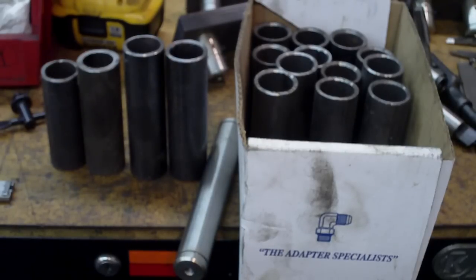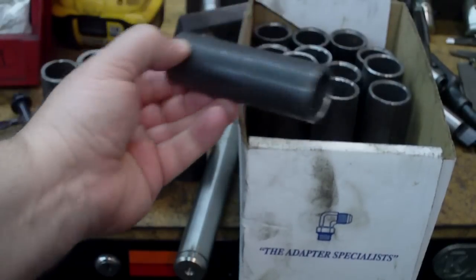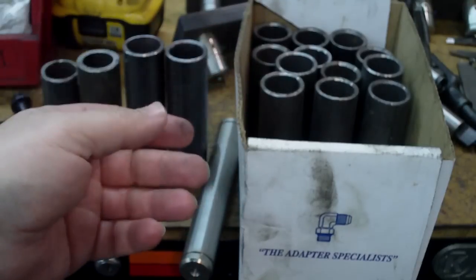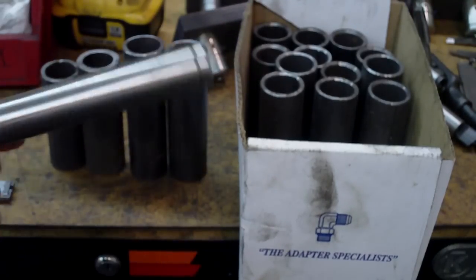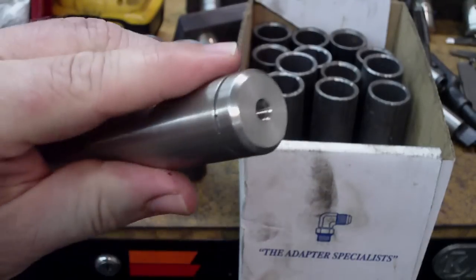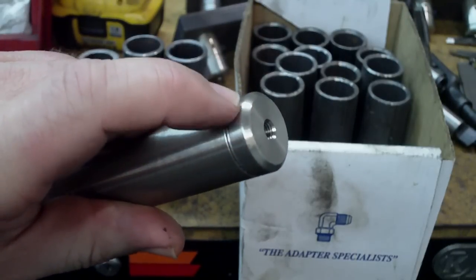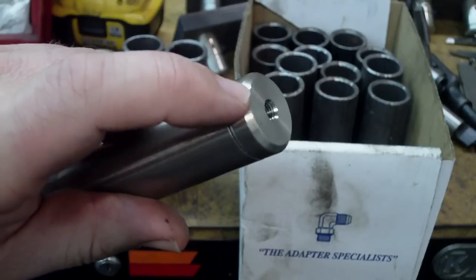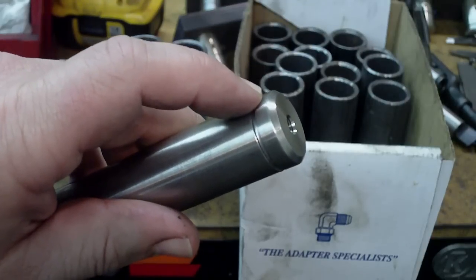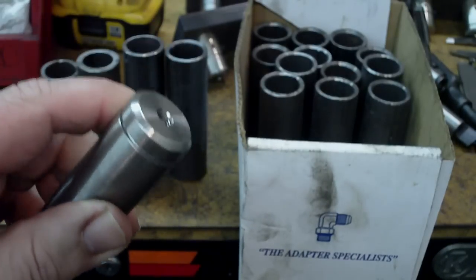What are we doing tonight, or this morning? Well, we got a whole box of these parts right here. These are the tubes that the pivot pins for each of our kits go in. We cut them off on a bandsaw and the pivot pin goes in it. The pivot pin has a chamfer right on the end — that's to help you when you put it in. First it's got to go through a tight bore that's already powder coated, then through this tube, then through the other bore on the other side — on the bottom of the hoist and on the top of the hoist.